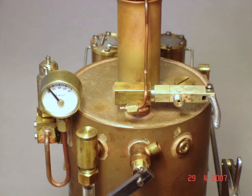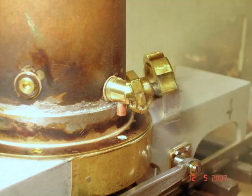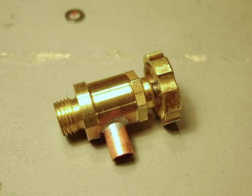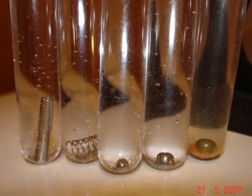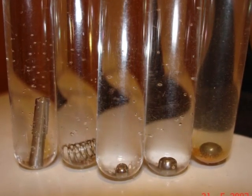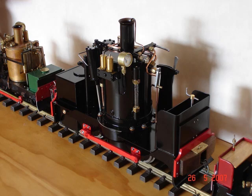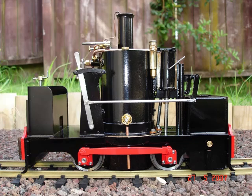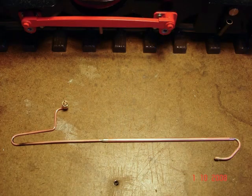The whistle valve fitted to the steam manifold. The boiler has a drain cock — I like to fully drain my boilers after a run. This valve is of the safety spindle-cannot-be-fully-unscrewed type. The whistle valve developed a fault — it turned out that the stainless balls a local supplier sent me weren't stainless at all. Baking the new black paint on the boiler using my Sievert 3757 stand. The loco is mostly finished here; from the dates on the photos it has taken one year and two months to get to this stage — I'm a lot slower now. A month later the blower pipe failed due to the extreme heat in the flue. It was repaired by thickening it with a 3/32 copper tube in the risky area — it hasn't failed again. Fingers crossed.